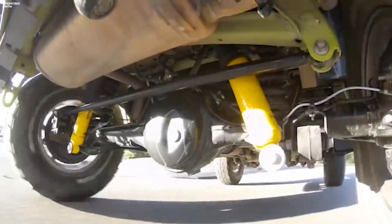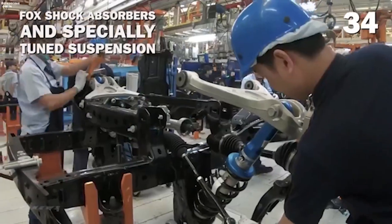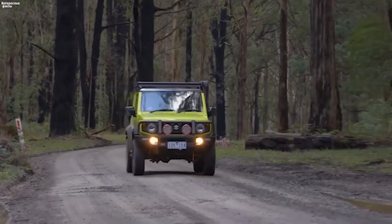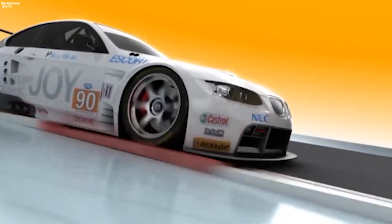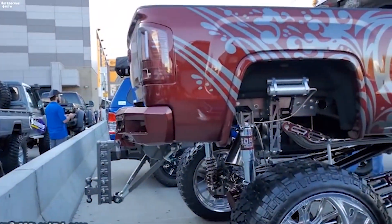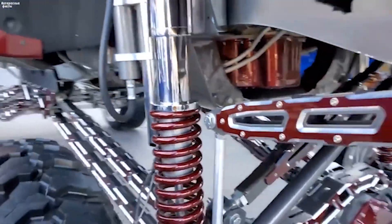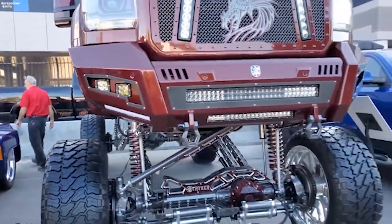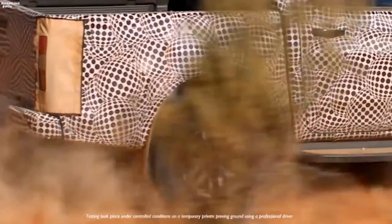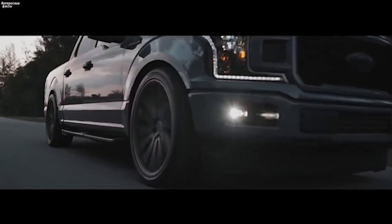The ratio of sprung and unsprung mass is of great importance, because the force with which the unsprung components act on the vehicle from bottom to top must be compensated by the weight of the sprung mass. Otherwise, the vehicle loses grip and stability, which affects its handling. To solve this problem, manufacturers try to reduce the unsprung weight as much as possible by installing alloy wheels, lightweight tires, and making other elements and materials as light as possible. In off-road vehicles and ATVs, this problem is even more acute, because in order to overcome obstacles they need a reliable, heavier suspension, wheels of large diameter with massive tires, and a four-wheel drive (4WD) system. All this leads to the fact that the unsprung weight of such vehicles is very high — that's why it's hard to imagine drift racing on an SUV; it will just flip over.